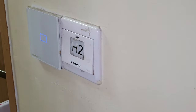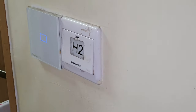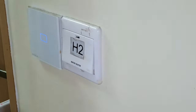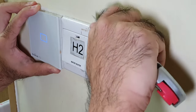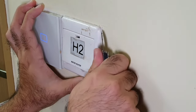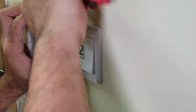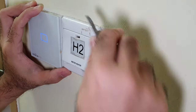As I have mentioned in my previous videos, the painters usually paint all the way up into the switch cover, and when you remove it, the cover will come off with a lot of paint. So before you remove any switches in your house, let's grab a blade and start cutting around the switch perimeter. You just want to break the paint so that it comes off cleanly and you don't have a whole chunk of paint coming up. Sometimes there is a line of silicone that goes around the switch, so you want to take your time and make sure you separated the switch from the wall.